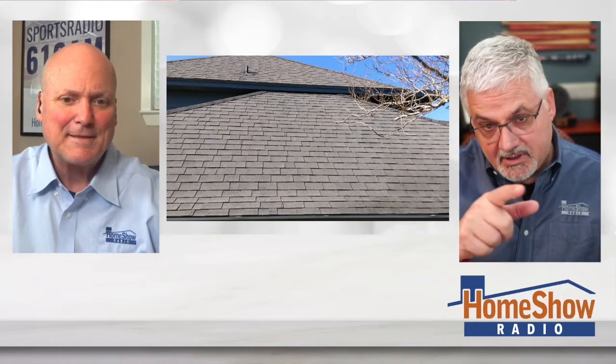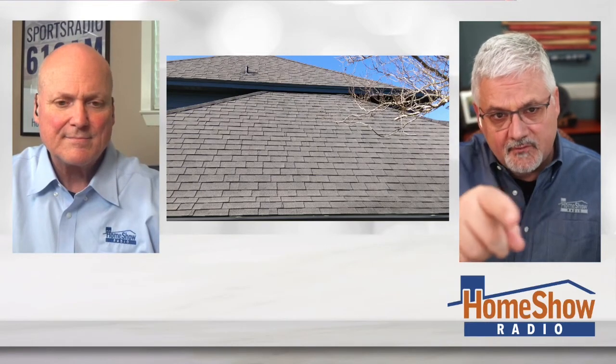But in this case, is this what you'd call a hip roof? He's got a hip ridge on there, but it's got a ridge. He could do that. Now, the problem you have in that particular picture — it's so tight, there's no wall going up. I don't think he's a candidate for it right there. It's so tight to that upper soffit where there's no room. I would probably put two air hawks right there — the little square slant-back vents — and call it a day, because it's going to be about the same amount of opening as a ridge vent of maybe 8 to 10 feet. The opening is going to be pretty much the same because you don't have a lot of room.